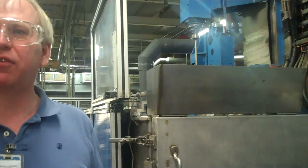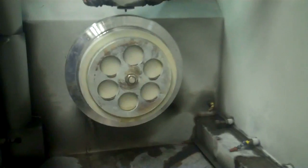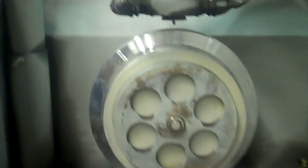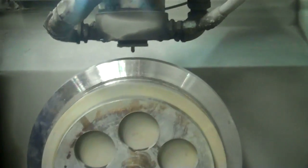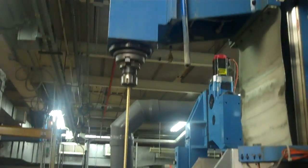What you see here is GE's first Blue Arc machine. The configuration is similar to a milling machine and can be used to machine and generate any feature that you can normally generate on any other milling machine. The cutter is submerged to aid with cooling and to help shield the arc discharge. High pressure flushing is used to evacuate the chips from the cutting zone.